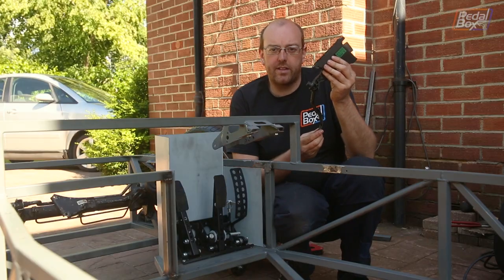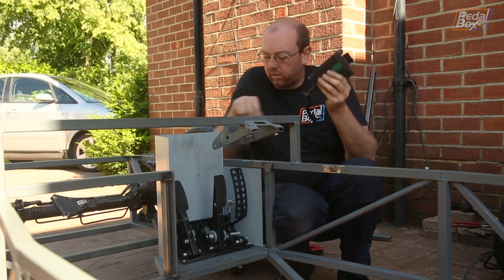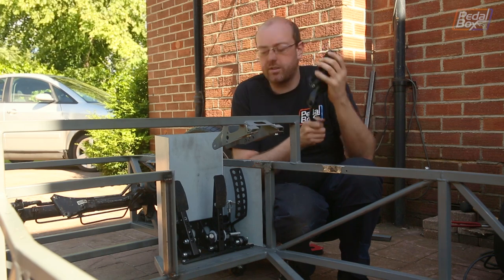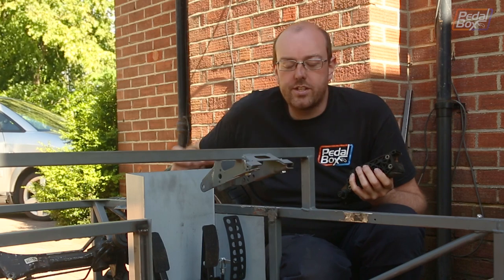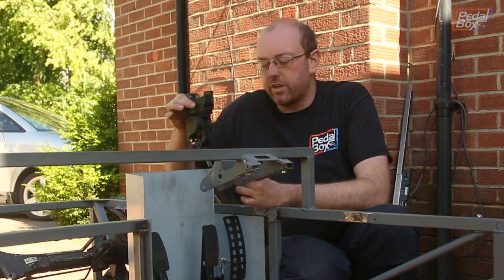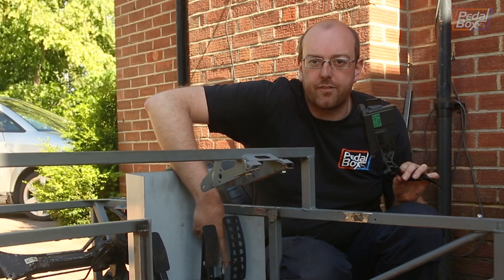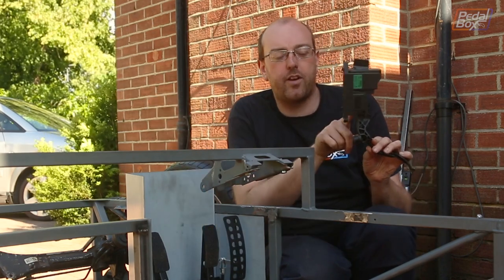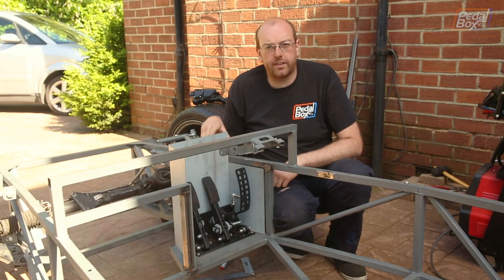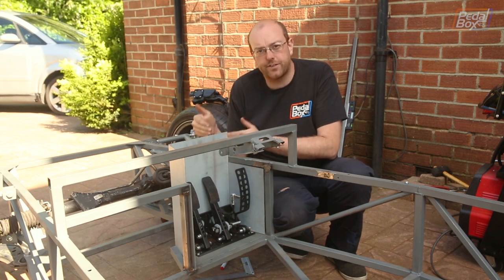It's not quite as easy as it sounds. If it's positioned higher up, similar to how it would have been in the Audis, we run into a clearance problem — this rubber stop and the back of the pedal come into contact with the bulkhead itself. If we're cutting into this to make it work, we might as well make a small box on the back so it sits slightly further back. We cut the pedal off, mount the linkage from our existing floor-mounted pedal onto it, and then we have a fly-by-wire throttle operating off our existing pedal. But before we build that box, we need to work out exactly where our steering column comes through and how much space we'll have to fit that module in.